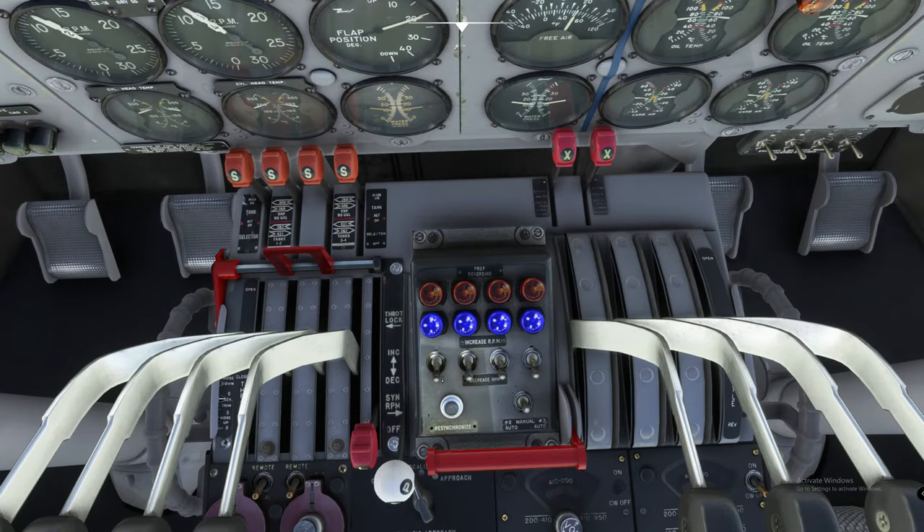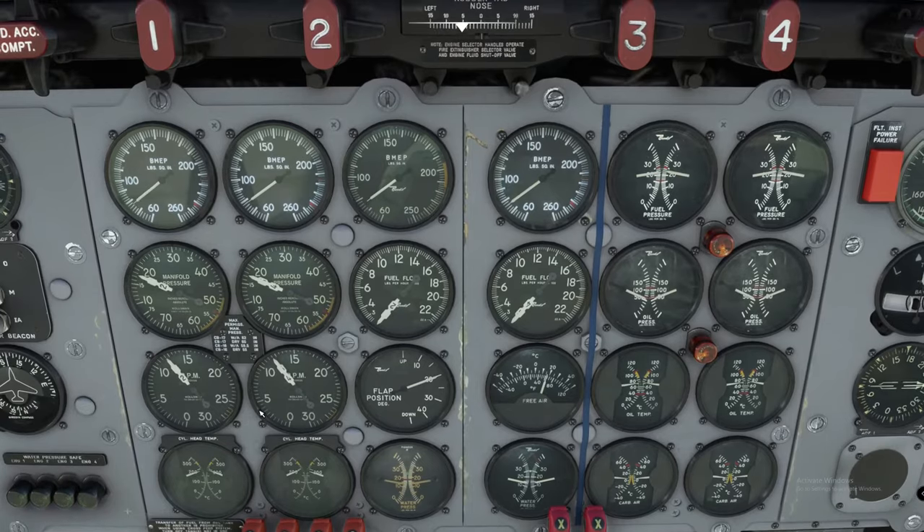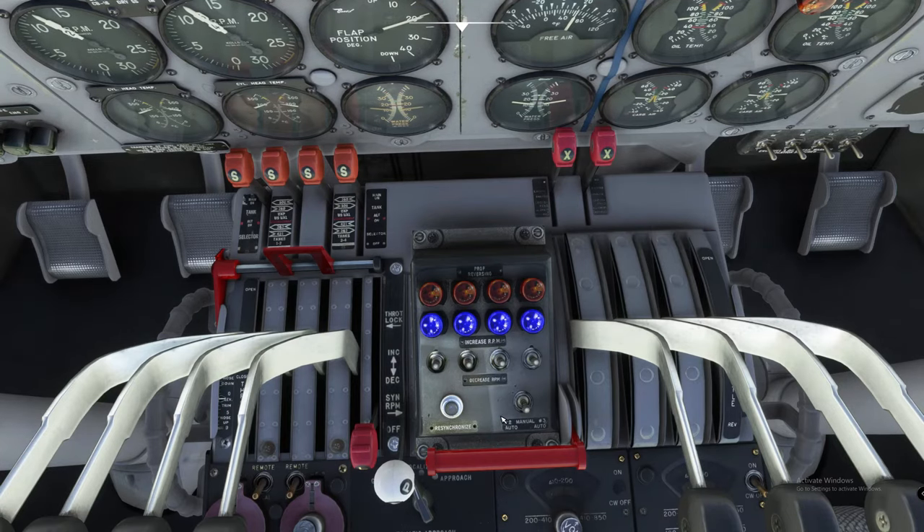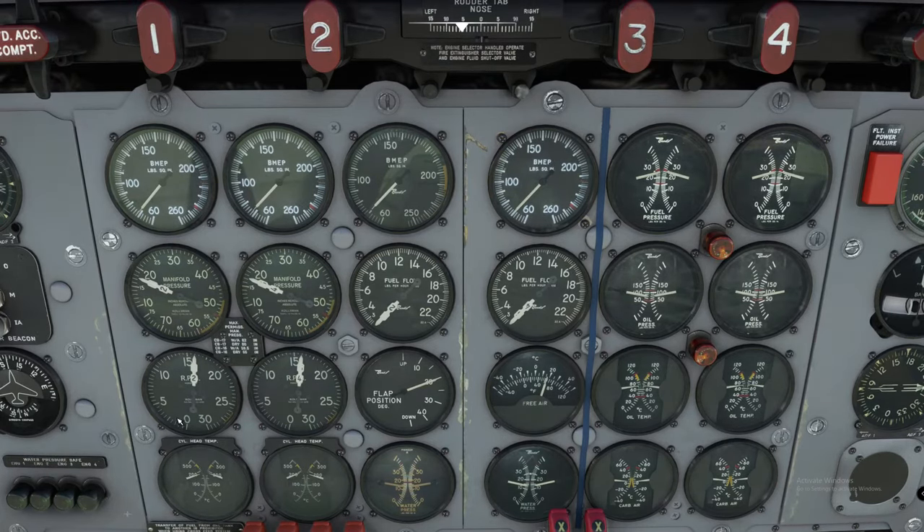We've got them in blue. We can go ahead and put these back into the neutral position and take note of our RPM. Now that we've got them back to normal, we can take our prop master lever switch and put it all the way forward. Nothing should happen — the RPMs should not increase. That worked out good. So we're going to put us back down in the full low, switch our switch back to 3, then put in full RPM increase. We have come back up to 1,600 RPM and that is good.